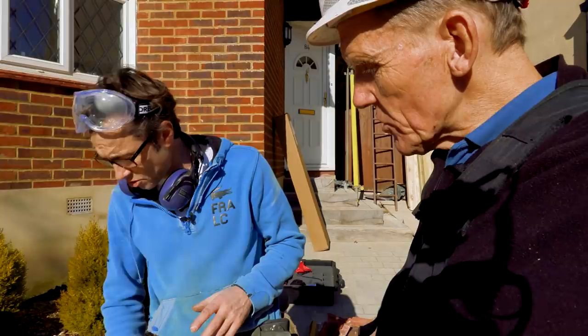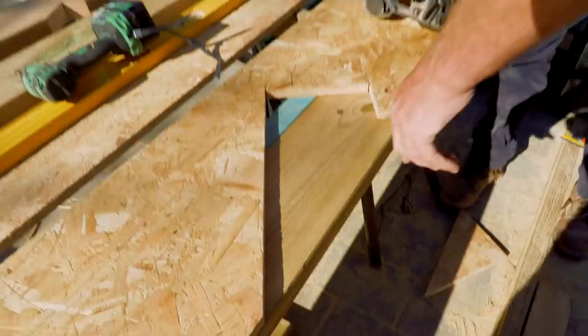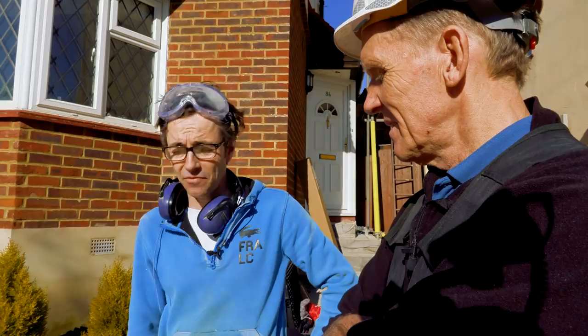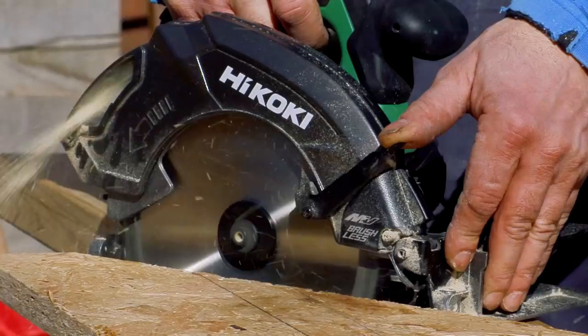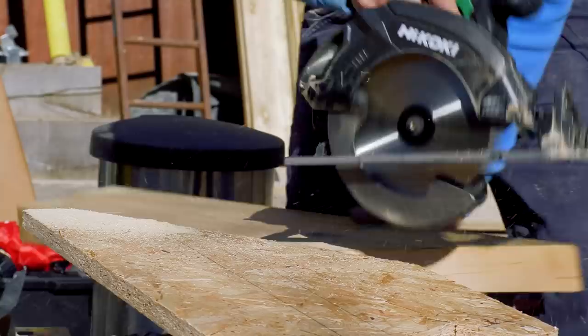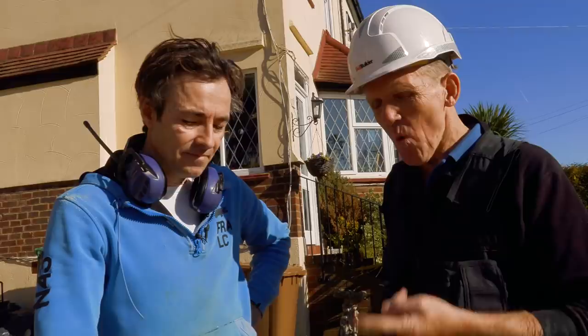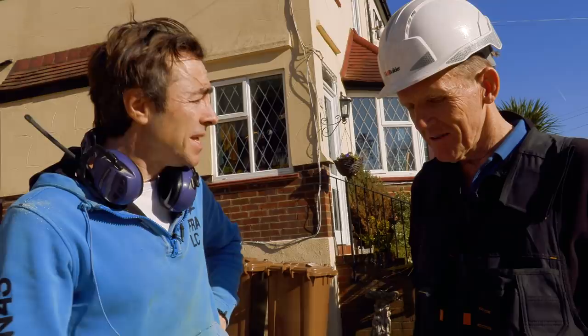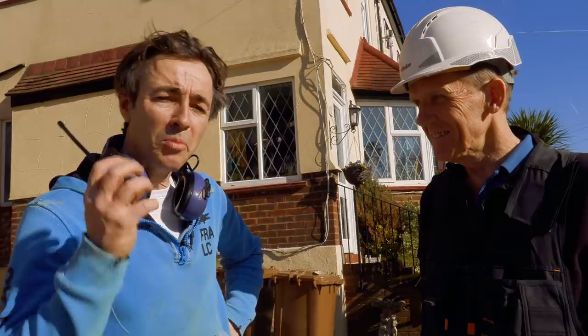So that's doing your soffit cut and your bird's mouth - the whole rafter. You're going to be a millionaire! Patent it, Robin. The only thing is someone will say: what if it's a different pitch? You've got to make one for a different pitch - as simple as that. This will suit 35 degrees, and it might not suit another roof at 35 degrees either - this is for this specific job. The price of that OSB is not even a quarter of a sheet. What are you going to do with the time saved? Get the job finished quicker and earn a bit more money.